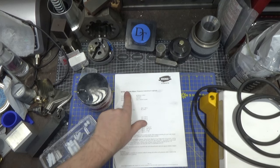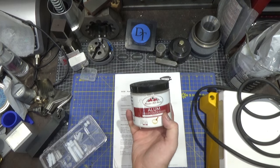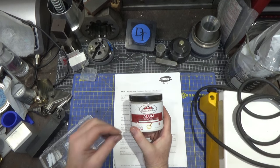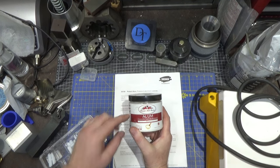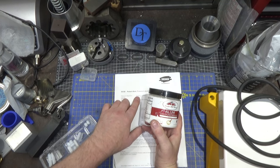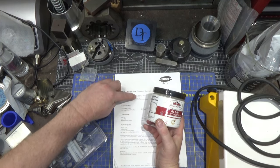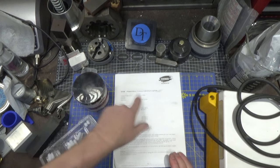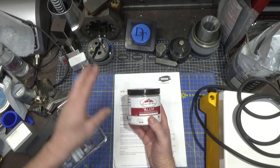Our solution to dissolve that tiny tap involves a chemical known as potash alum, or potassium aluminum sulfate. Alum is readily available — you need to get the potassium alum version. There are a whole bunch of different kinds of alum. Potassium alum and ammonium alum seem to work the best; other alums may not work at all. Make sure you get the right one — that's the whole point rather than confusing you with the chemistry.